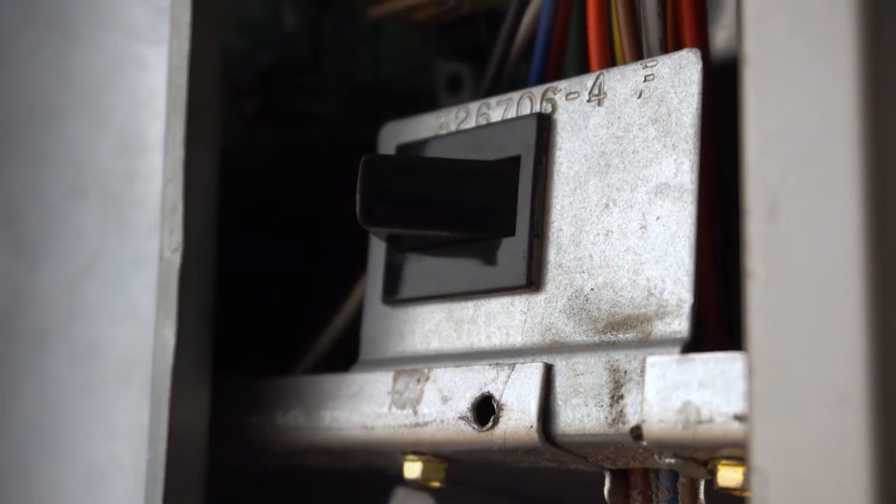So we're going to end up pulling an old switcheroo on the furnace. Every furnace or air handler has a pop-out switch so that if a homeowner takes the door off, they're not going to be at risk of hurting themselves. Contractors know when they take the door off, if they still have to troubleshoot, they're generally going to put electrical tape over that pop-out switch so they can troubleshoot appropriately.